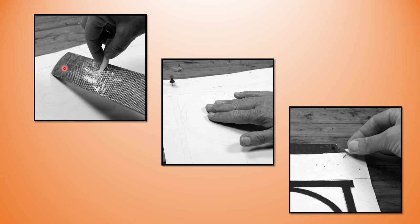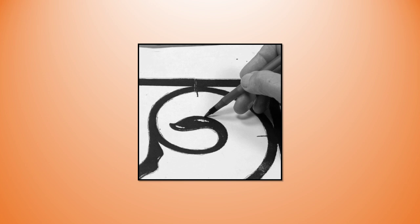You can find it useful to use a sheet of coarse brown paper such as a grocery sack, chalk that first, and use it like a piece of carbon paper putting it underneath the drawing as you transfer the drawing — it feels a little better as you work with your ballpoint pen. Go around the outside of the drawing with your ballpoint pen, and you want that pen to be red or another bright color so it stands out against the drawing, showing where you've worked or more importantly where you still have work to do. You don't want to miss a piece.